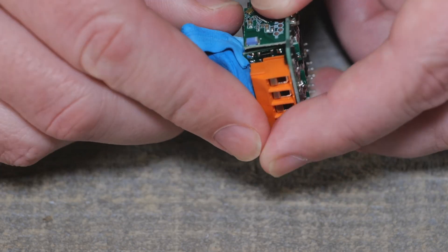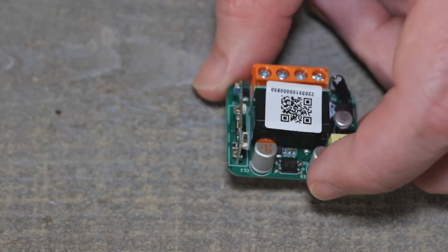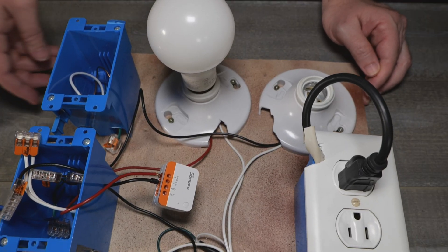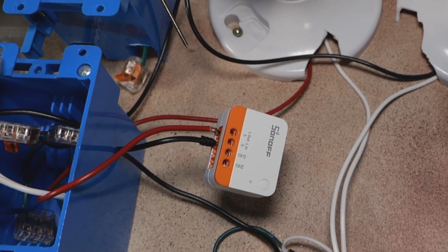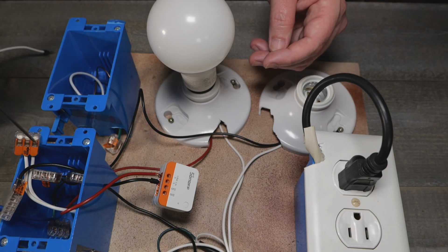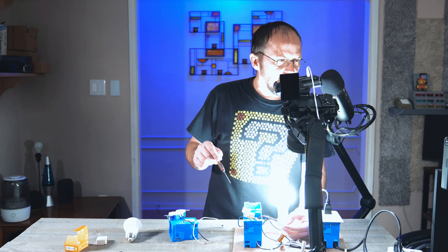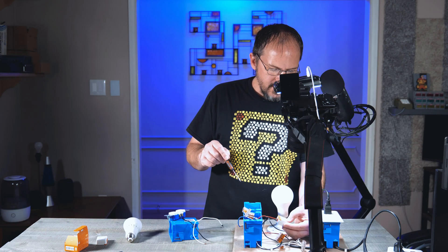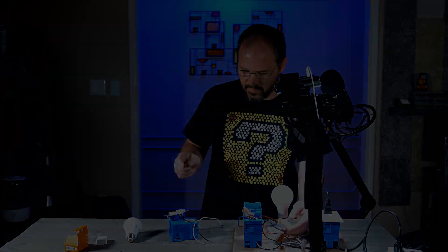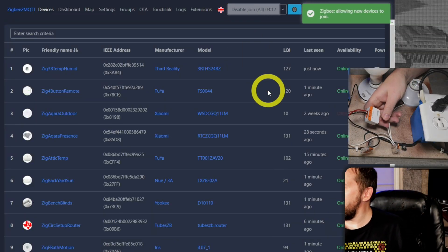Let's go wire this up. I've got a little test board I can do a no-neutral on and line things up. So this is just my little test board — I know the exposed copper will freak some of you out, but I won't be touching it. It does work — hear it clicking on and off! Let's get it paired into Zigbee2MQTT. We'll do our permit join all and hold the button down for a few seconds.